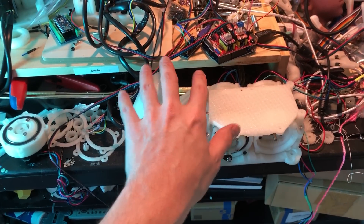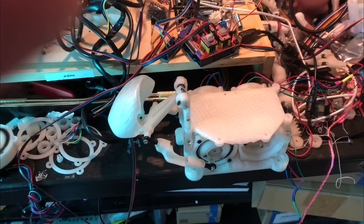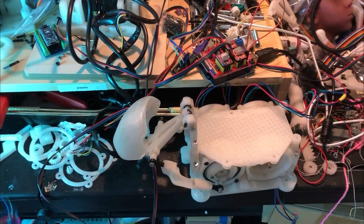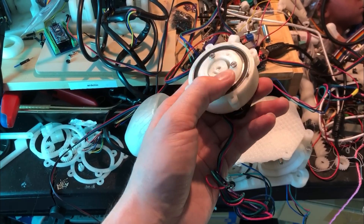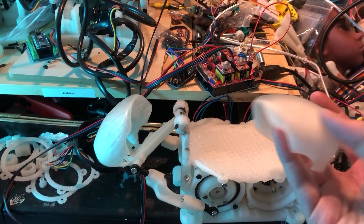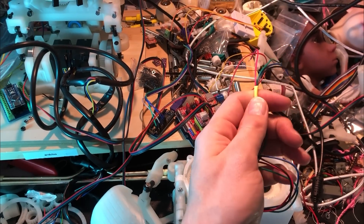This is to control some shoulder motion. I'll just take that out and put this in. This is a little bit taller than the previous module — got two motors in the front, two in the back. There's quite a lot of small motor planetary gear on the front of it, about five to one. These shoulder caps get all the wires routed out of the back, and I've color-coded each motor.